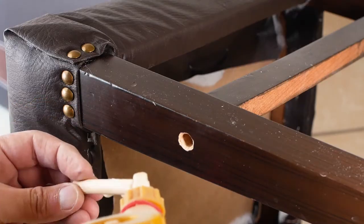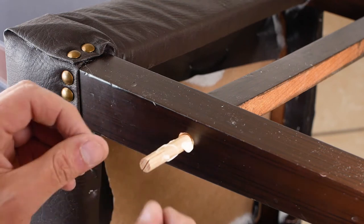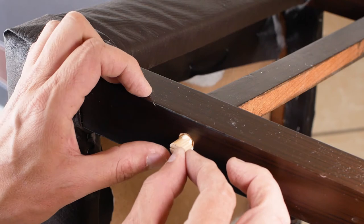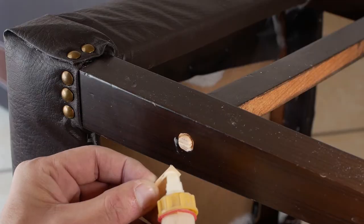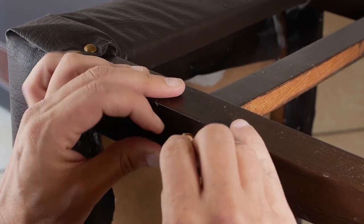Now to glue in the original dowel rod with the cut-out in place. The hole size turned out to be slightly larger than I would like, but no worries, as the glue when dry will be stronger than the wood fibers. I orientated the dowel so its wood grain matches the vertical wood grain of the front leg. Now to glue the wedge and tap it home with a small hammer so the dowel will be firmly stuck in place.